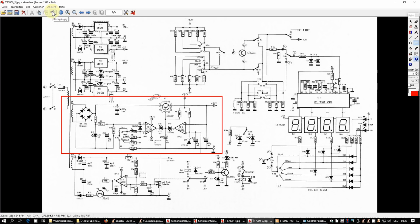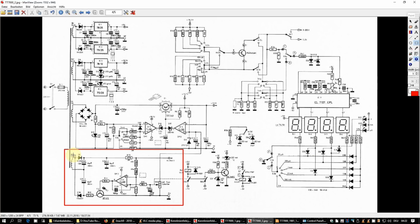And the last thing is here the high voltage generation for the breakdown testing. This is this part here with a 90 volt, 20 milliamps secondary winding, a simple 2-diode rectifier, and again a pass transistor, this time in the ground connection, simply because they're using a PNP, a BF472 high voltage transistor, and a single op amp as a regulator, and that's all. Here's the potentiometer for setting the collector voltage, and you can see this goes up to 200 volts, but it can only deliver a few milliamps. So that is all, and you can see all in all the circuit is relatively simple, so it is suitable if you want to build one of your own.